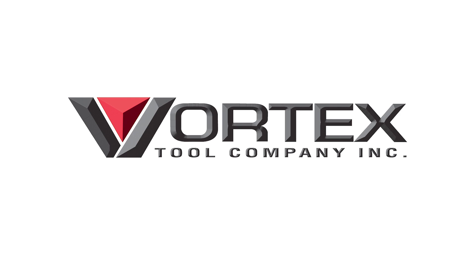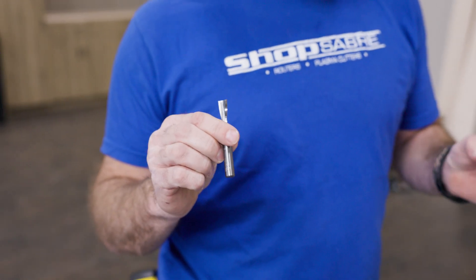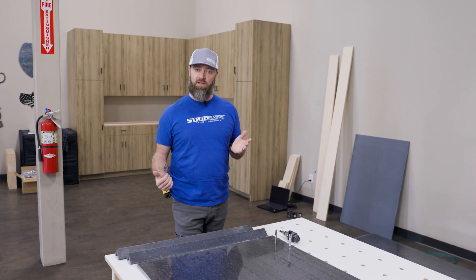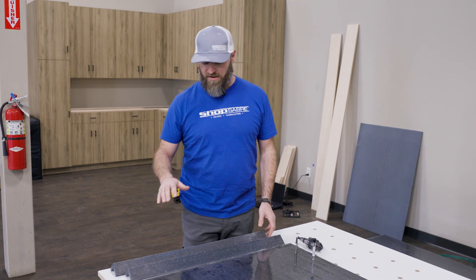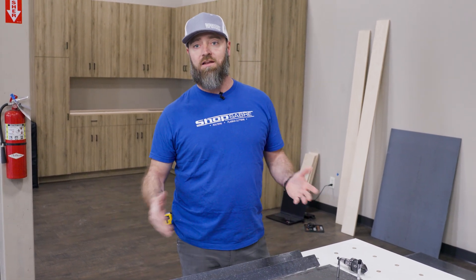I did talk with Vortex — they supplied us with tools for this. We're going to use a two flute up shear 4240 tool for our cutouts, and then we're going to do miter folds using an insert miter bit. This material comes in 12 foot lengths and we've only got an eight foot bed on the machine, so we cut some off and used that to play around. I did a couple of tests with the miter fold, dialed into what's going to work the best. Now we're all set — the tools are set up and we can start cutting our countertop.